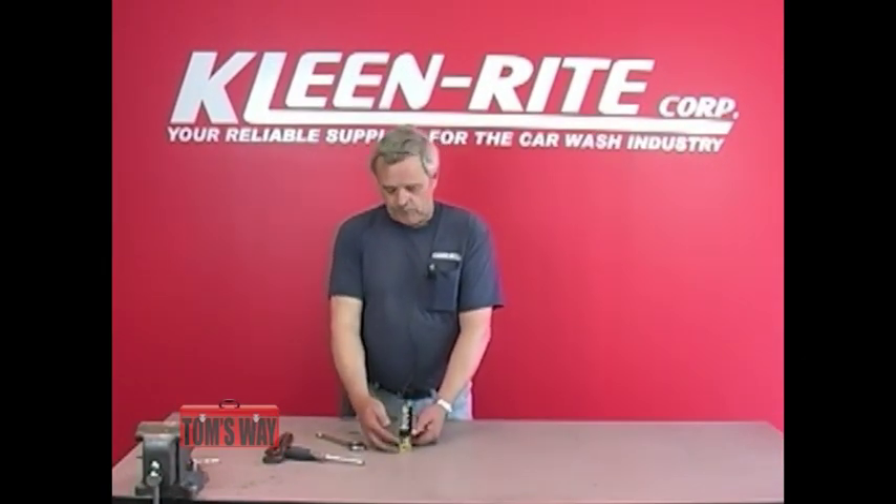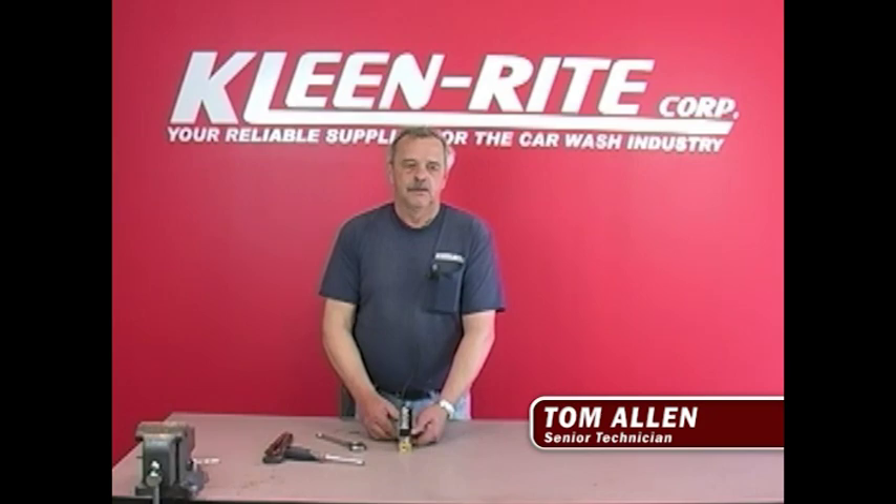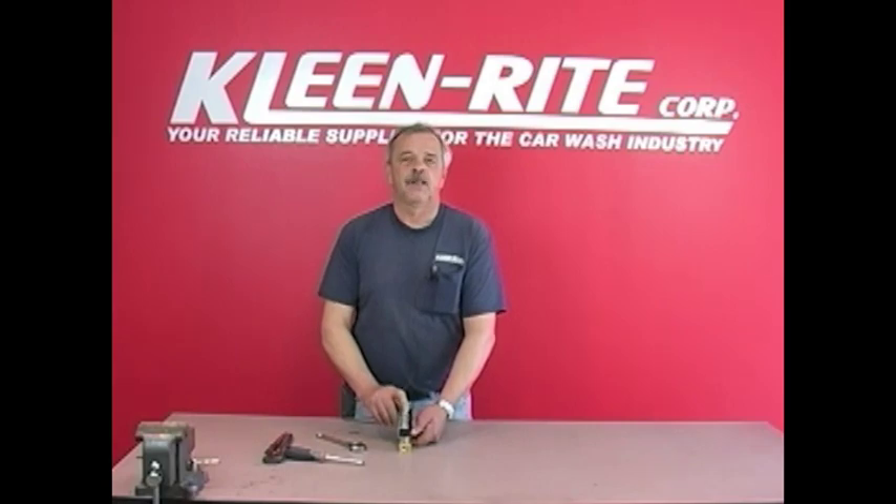You've completed the repair or cleaning of this block. Repair kits do come for this separately, and you can also buy coils separately depending on what you need. Don't cut corners — if you need to put a kit in it, put a kit in it, because it'll just give you more problems down the line. There are times where you'll clean one solenoid and it still won't work — you need to clean them all, not just one. If the top or bottom one plugs up, it will also affect the draw on the others. When cleaning this box, clean the whole bank of solenoids, not just one.